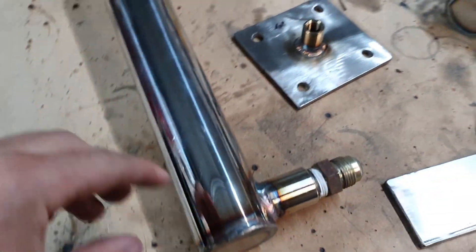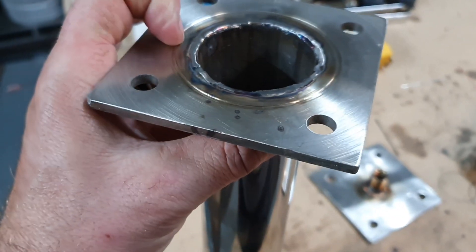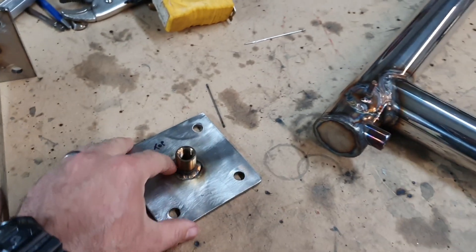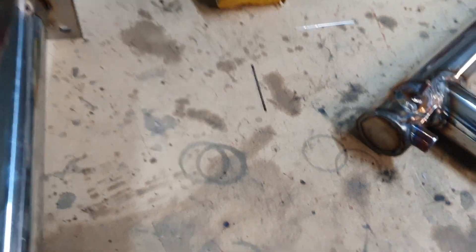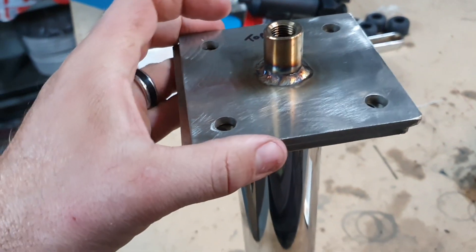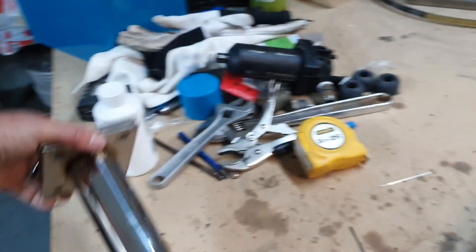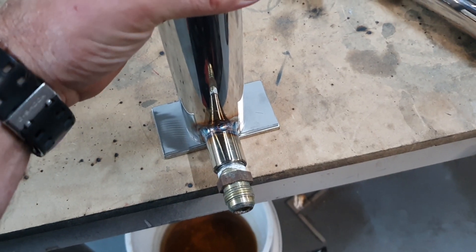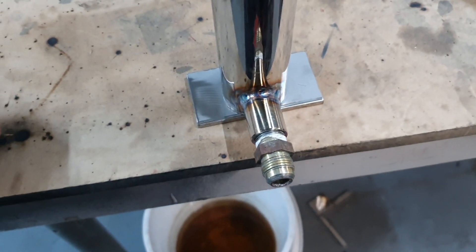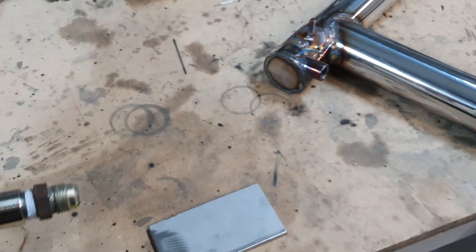Here's what you just saw me do: our top welded in with the o-ring groove - you can see I've machined into it - got this bung welded to the top plate, so he's ready to go. Here's the one that goes on top with an o-ring between the two, four bolts, Bob's your uncle. We'll actually weld the bolts on from underneath so only one spanner is required to get into the filter. I've got this piece of plate here - I'm going to weld that to there, hole here, hole there, and that will bolt down to that plate which is the motor mount. Hence, it's removable so you can pull the system apart easier.